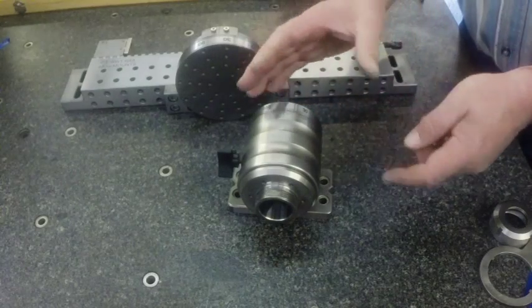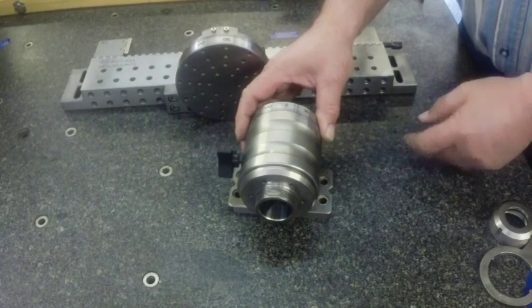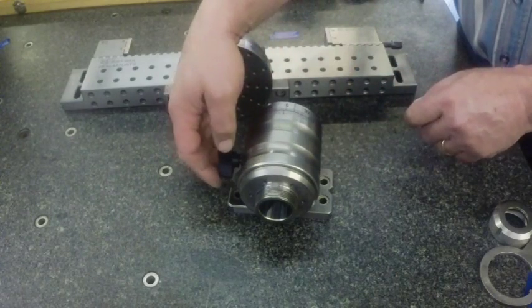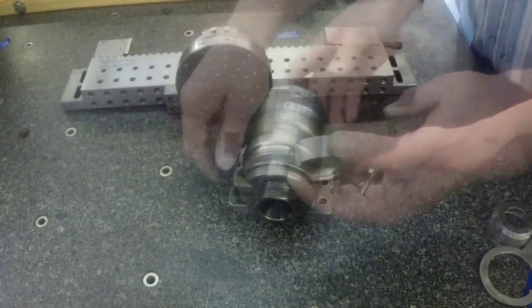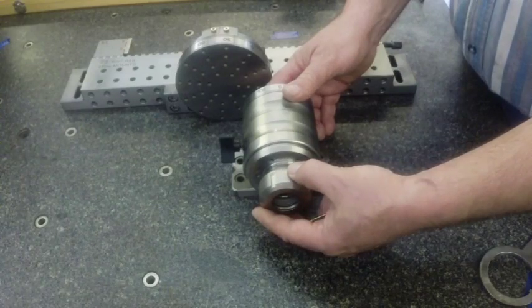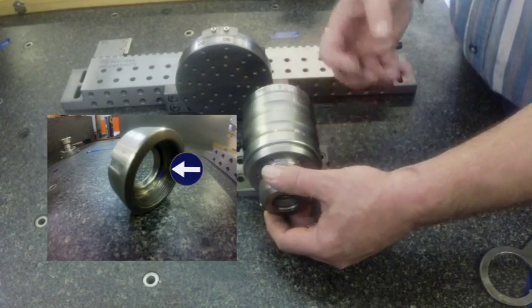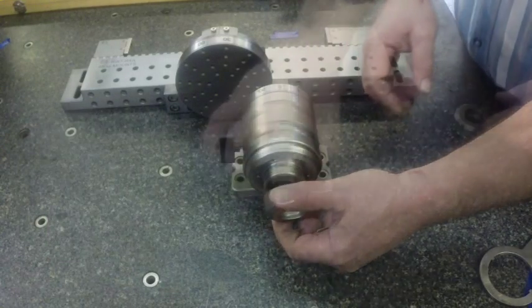If you're looking to go somewhere between that five-degree step, you can visually bring it to whatever degree you want and then lock your side down. The collet nut will draw your collet in, and it has a ring in the collet nut that as you're loosening it pops the collet out to release the seat.